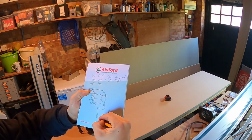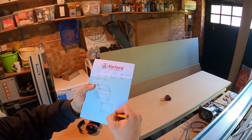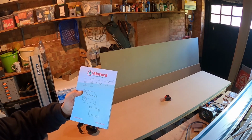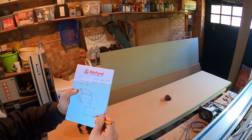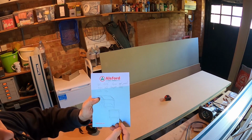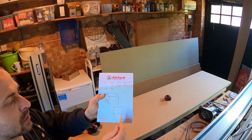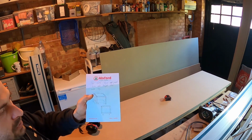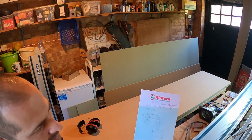And also, if you imagine you've got your legs on, sometimes units come with the sides fitted all the way through, so you're only relying on the bottom piece and on dowels and screws which hold the unit together. But this way you ensure that all the weight goes down onto the legs. So that's why I make the units this way, not having the sides going past the bottom, which you can see in Howdens units and all the other kitchens and stuff.